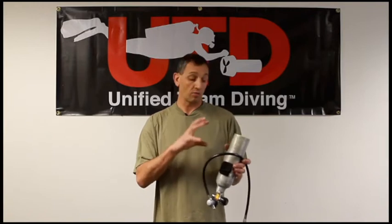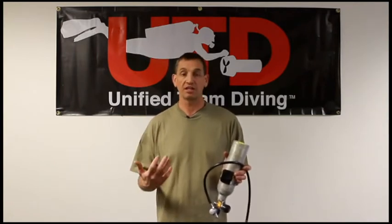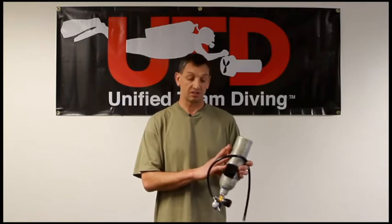And the argon bottle that you're going to use, or the alternative air source that you need for your suit, is because you're running helium in the back gas. And that's the main reason. If you're running helium in the back gas, you do not want to be filling off the helium into the suit. You're going to need this system.